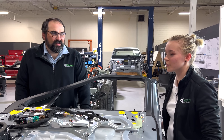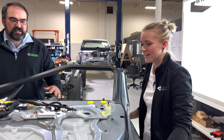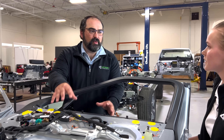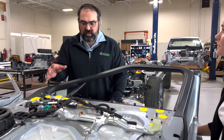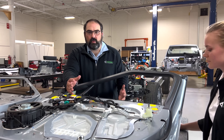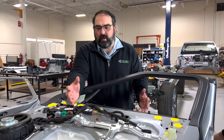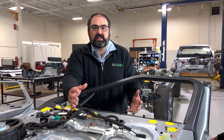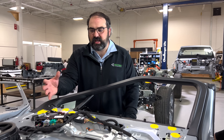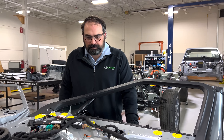It's impossible to do anything with the window regulator except through those two holes. This is a stick-built door — the window regulator and glass are all brought in and assembled inside the door. That's very similar to the Plaid we looked at in the last teardown, and also what Ford has traditionally done with the F-150. We were expecting to see a module here that would allow components to be brought in pre-assembled from suppliers, reducing the workload at the Rivian plant.